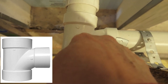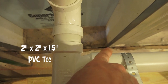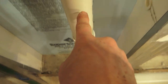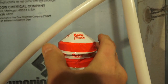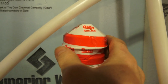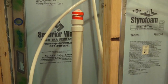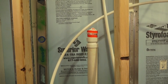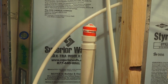We're running right into a T here — a two-inch T, with two-inch on two sides and inch-and-a-half on the other. We're going off the right side inch-and-a-half for the drain line and coming off the two-inch side into our two-inch vent. This particular bar sink is vented to a Studor vent, which lets air into the line but doesn't let air out, so you get no odor from your sewage lines. You can buy these at Home Depot. They're not acceptable everywhere, but in our area we can use a Studor vent on a small bar sink.